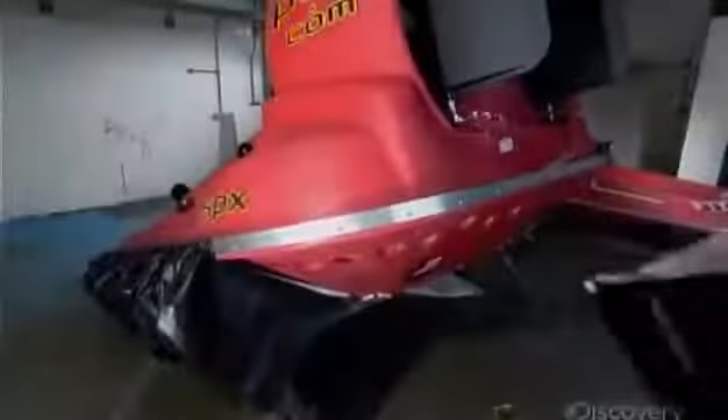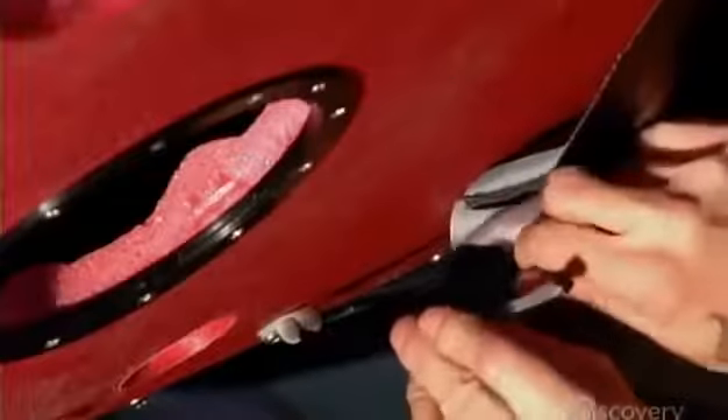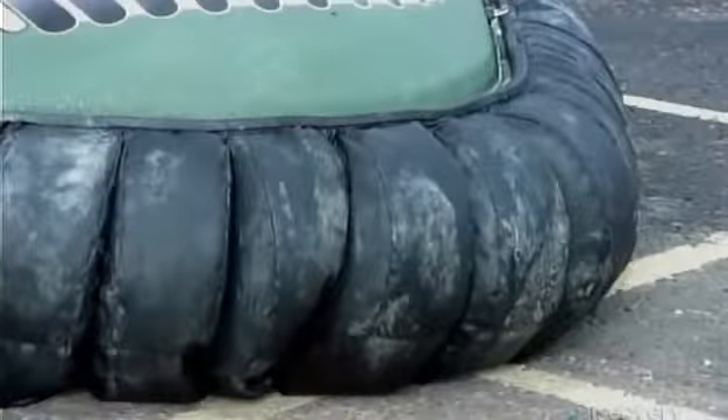The hovercraft skirt is made of the same material used on shoe soles — sturdy polyurethane nylon. They assemble the skirt to the hull in 65 different pieces. The worker loops each segment over a side bumper and secures it with a steel clip, then attaches the bottom of each skirt piece to the little hooks on the hull using plastic cable ties. If the skirt becomes snagged on something, these ties will break and free that section, allowing other parts of the skirt to balloon out and maintain the air cushion — and they'll only need to replace the damaged section, not the whole skirt.